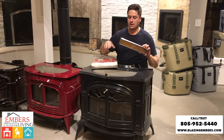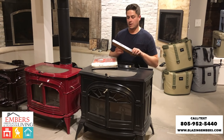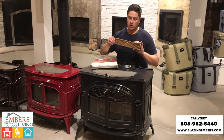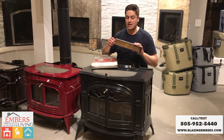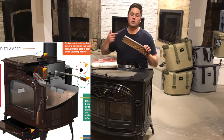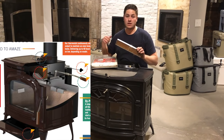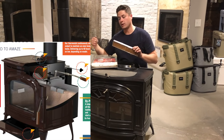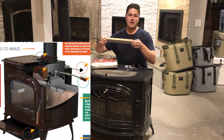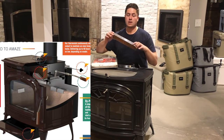It's a little more scientific than a re-burn stove, but basically that's why we have a damper bypass — because we want this away from the heat and low temperatures, because the temperatures are too low to create a chemical reaction to allow the system to re-burn. So that's why when we exceed temperatures over 500 degrees, we're going to put our bypass away, and now our catalytic combustor can go into effect.